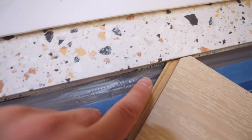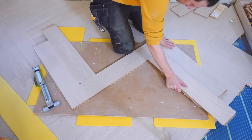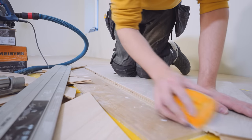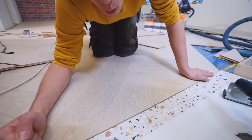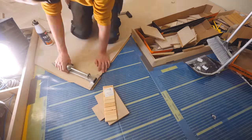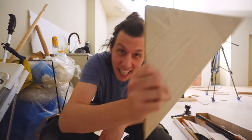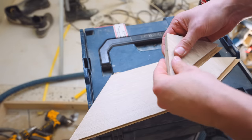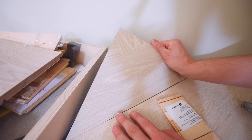I've already cut two reference pieces to the correct gap. The plan now is to take all this back off, assemble it as one big unit with the missing pieces, then take my track saw and make one continuous straight cut. With any luck, once we assemble all the pieces back together it should all fit, and we'll have a consistent gap between the tiles and the wood floor. This is the last piece that will go in the kitchen floor — this little triangle is actually four individual small pieces that are all cut to size and glued together. Here goes. Perfect — look at that!